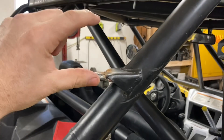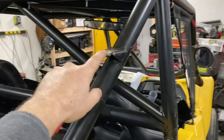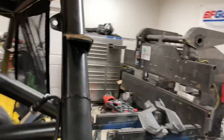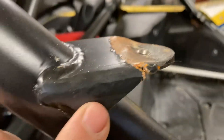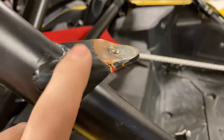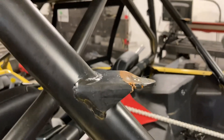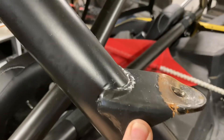So this is my original design — it's just a flat tab with one gusset. It's just not strong enough. He ordered springs to go in here so that they'll be able to bend when you hit tree branches, but I'm still going to cut these off and redo them. This one's all mangled too. So I'm going to redesign these and show a couple little tricks that I've learned the hard way on making stuff like this. It'll make more sense when I go to the computer.